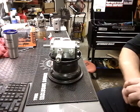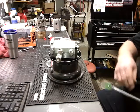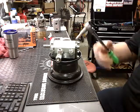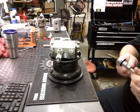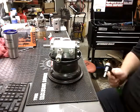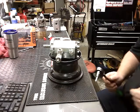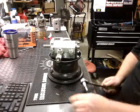Now the pump number is a Papa Lima Papa 20.14-49 Tango Lima 0 Foxtrot. You're going to need a few tools, and since it's made in Italy, you're going to need an 8mm Allen, an O-ring pick set, or a regular point pick, but I prefer an O-ring pick.